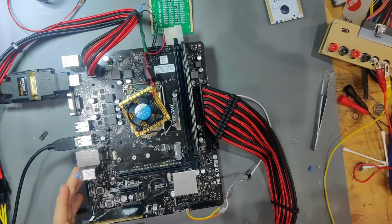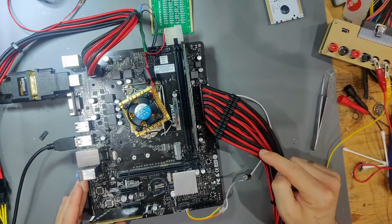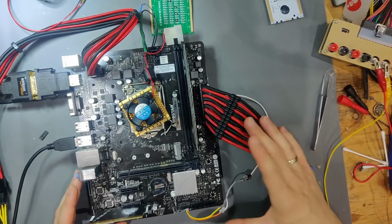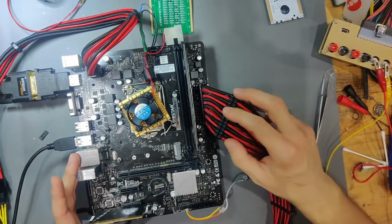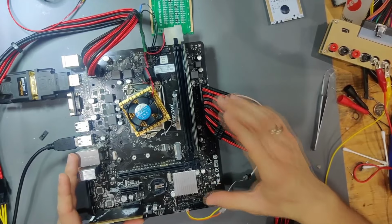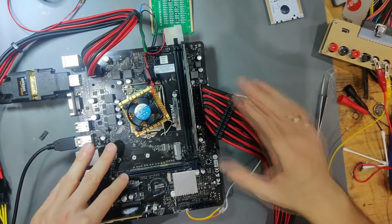And then this board threw a very, very interesting problem at me, because this board requires quite some voltage on the 5 VSB line. And I showed you that problem before. Because I have tried to dig into this 5 volt VSB circuitry so deeply without a schematic, just with the schematic of a H410 board of also Biostar. I've been going through it over and over again, trying to figure out why my 3 VSB auxiliary, which is on the PCIe slots, wasn't consistent.